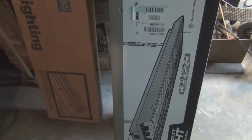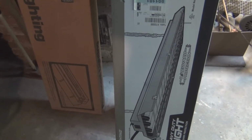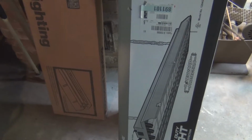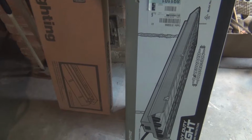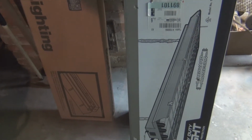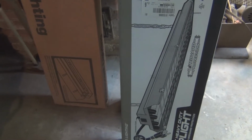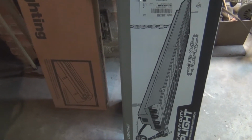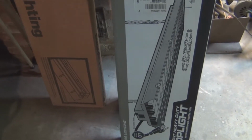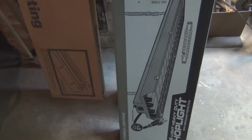You have to change those end connectors, which they call tombstones. So the traditional fluorescent lights, the T8s and the T12s, have shunted tombstones, I guess they're called. With electricity, you put a voltage on a hot and then the neutral, so electricity flows through the fluorescent light and ignites that gas.